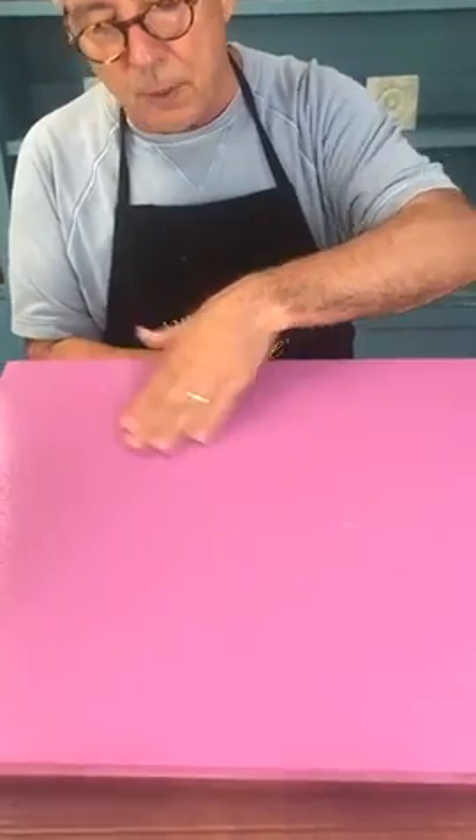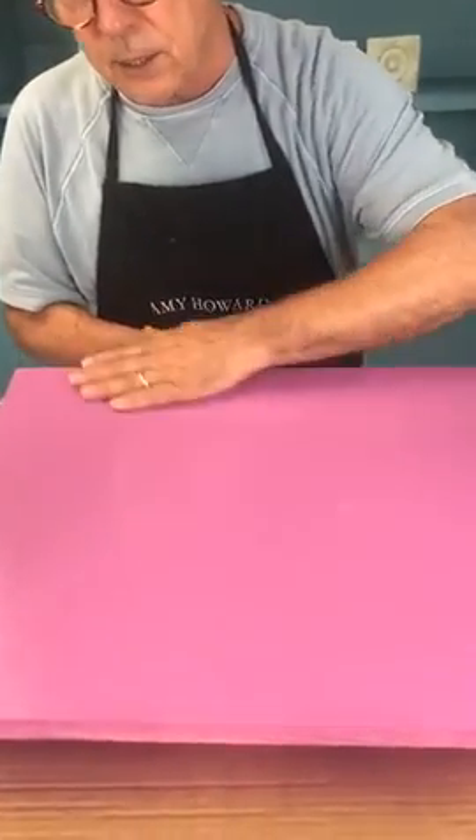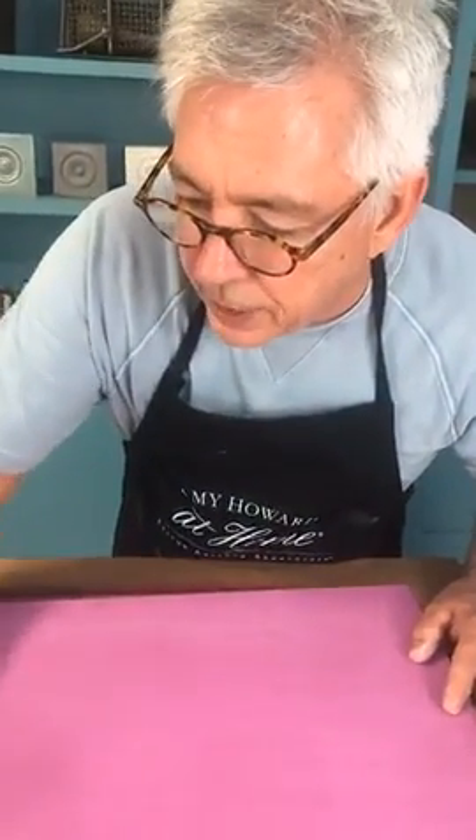This piece has about two coats on it so far. Look at the sheen — how uniform it is. You can see some of that grain because to really get rid of heavy grain you need a grain filler, but it doesn't affect our sheen. We don't have any dull spots or rough spots — it's as slick and smooth as it gets. I'm going to lightly sand it. The longer you let this dry before sanding, the better — at least an hour, maybe two. Sanding with the grain using 320 grit, though I'd prefer 400.